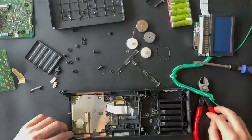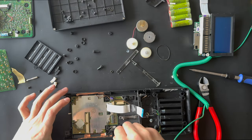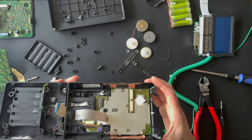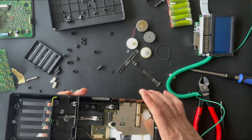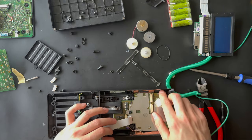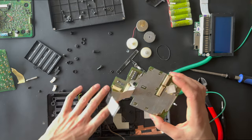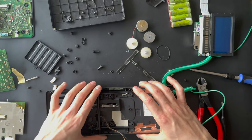Next step is to remove the main board. There's one screw here and one screw to the ground. Also, as I mentioned, all the Bang & Olufsen chassis — you can always find the serial number, software version, and type number in the chassis. Here's the gearing motion. Let's try to remove this one — and here is the main board. That was the purpose of purchasing the Beolink 7000.